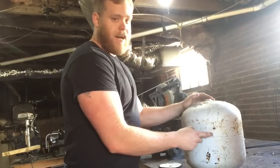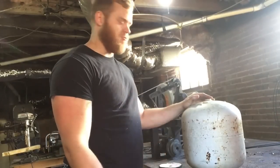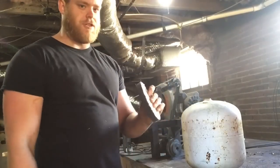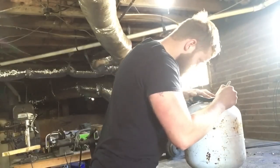This particular forge is going to have 2 burners, so that's more than enough. The rule of thumb is you want no more than 350 cubic inches per burner to reach forge welding heat. So, to draw it out, I'm just going to kind of cheat and use a discarded 6-inch buffing wheel and just kind of eyeball about 1/2 inch around it.